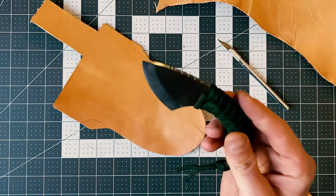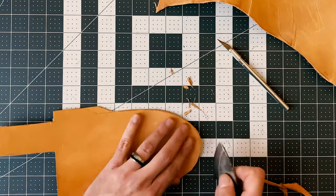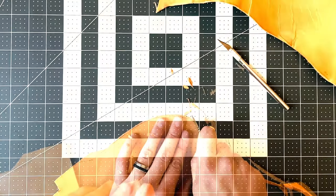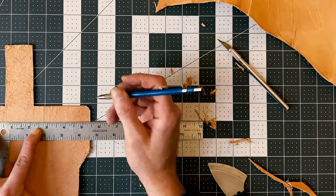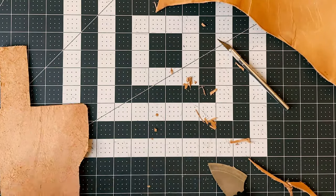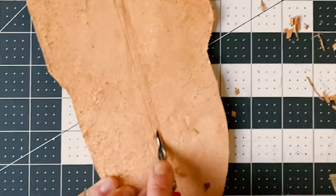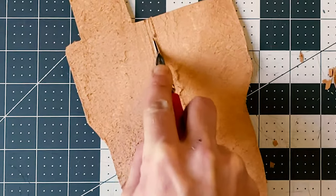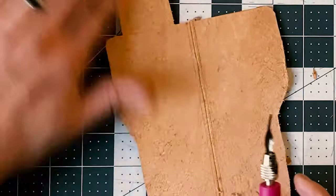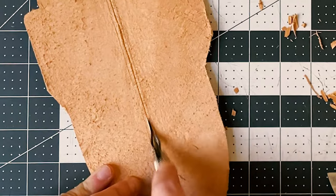This is a neck knife that Dustin of the Art of Craftsmanship made for me. I actually really like it for cutting leather. I'm not convinced I like the thickness of this belt loop — I might narrow that out a little bit when the time comes. So I just measured and drew three lines down the middle of my sheath. I'm doing this so that I can cut three grooves in that area, right where the sheath is going to fold. These grooves will remove some of the leather and allow it to make that radius around the blade a lot smoother.